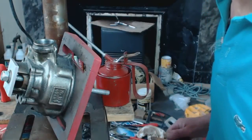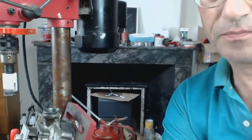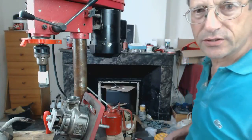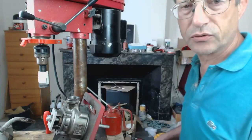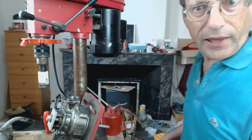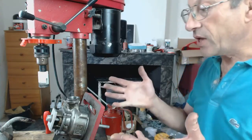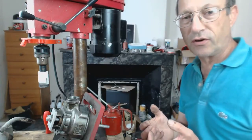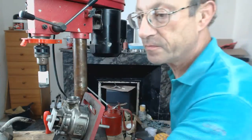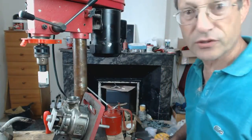We haven't got anywhere to put the O-ring now, but anyway, that's the mod. Sometime in the future I'm sure we'll change the barrel again, but at least this is going to bring our old barrel back into play, which was a nicer, faster, more fun unit. So there we are — that's how the exhaust output port can be bored out using these insert-type boring tools, with success.